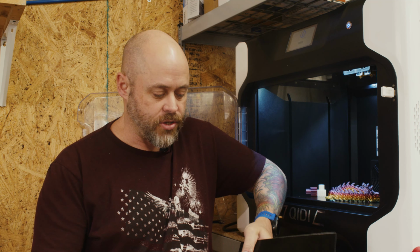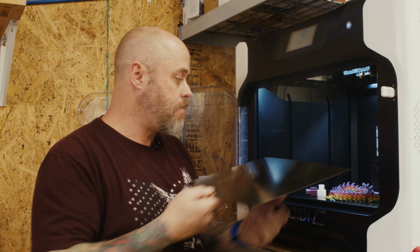I didn't do this one because it still has part of the dragon stuck to it, but I did it with one of these. I got another one with the package, and when I got that single head extruder with the ruby nozzle, it came with an extra one, so I got 3 of these now. What I did was I just sprayed hairspray on the flat surface on the back and put it on. And yeah, it's just perfect.